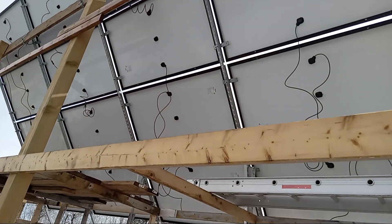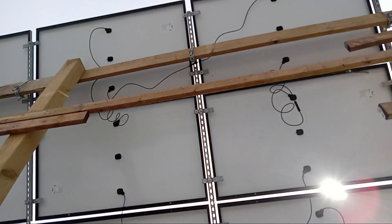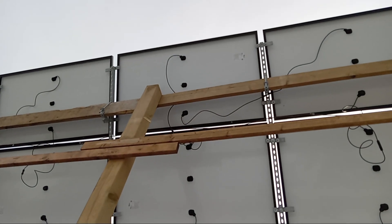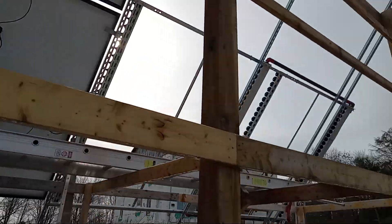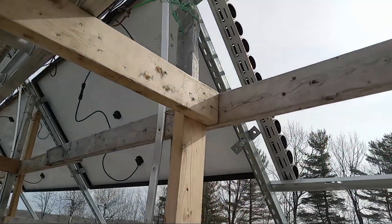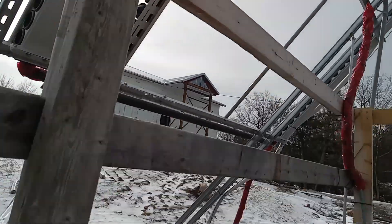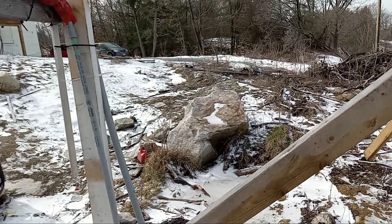I grounded each panel — there's a copper wire that comes all the way up and down, bonded at the junction. I had green leftover cable that I used for that. I also have a number 12 conductor going through that pipe inside the trench. Those are the things I failed on, and I corrected them, and I was able to get the solar panels connected.